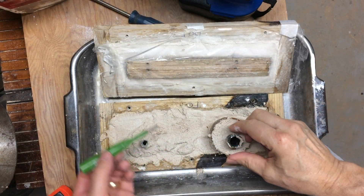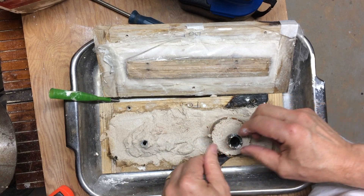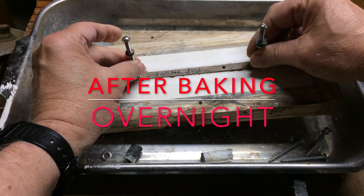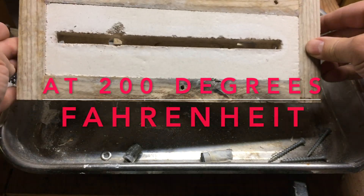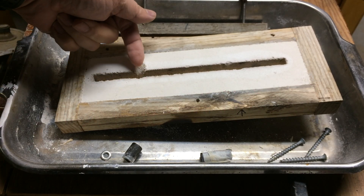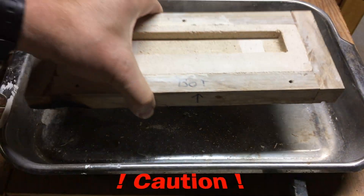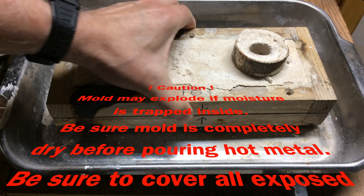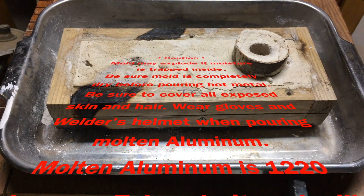The green plastic just helps the rubber expand so that when I take it out, the rubber will contract and make it easier to get that out of the hole. We're just going to pull that pattern out — that will work as a vent and overflow for the aluminum that becomes part of the top. There's a small void here, but that'll just be filled with some scrap aluminum — we're going to cut that part off from the aluminum bar that we cast. Now we put the bottom half of the mold back in, put the top half on top, and once we screw it together we'll be ready to pour some aluminum into it.